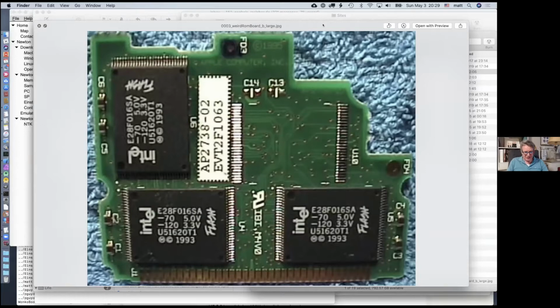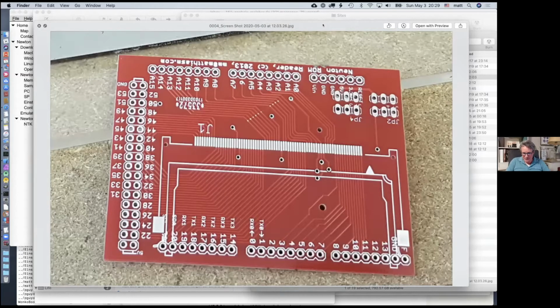So I thought we do the only thing that a sane person obviously does. We build a little printed circuit board that can read those ROM boards. What you see here is basically a board that goes on top of an Arduino and just plugs into the Arduino. On the lower half, you see the connector, and you can plug the ROM board in there. Then bit by bit, I can read it through the Arduino and give it over the USB port into a host machine. And we did, and it worked.